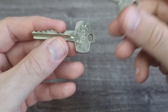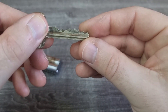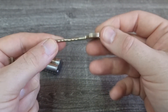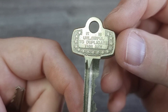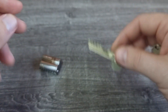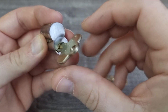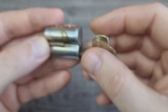This is the control key — look how different they are. That tells us there are three pins in every pin stack in that lock, because if both these keys do something in that lock, there's got to be three pins in every pin stack. It's unlawful to duplicate that key, so don't do it. Let's put in the operating key — pop that in and there you go, that's your lock open. Very simple, you get the idea, no problem.